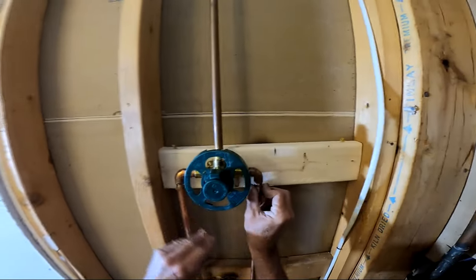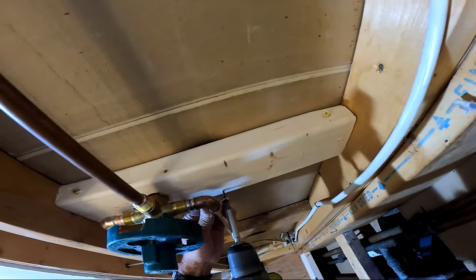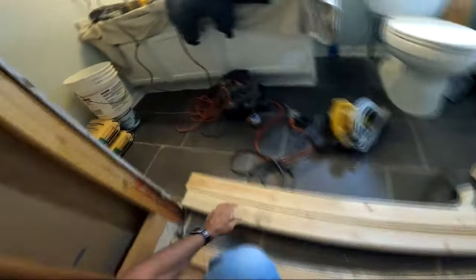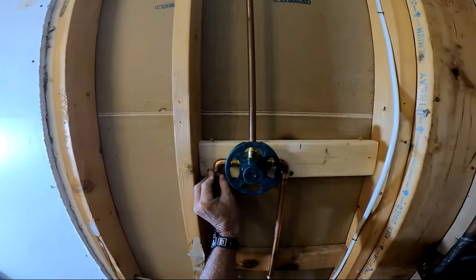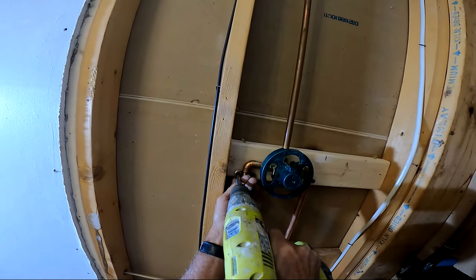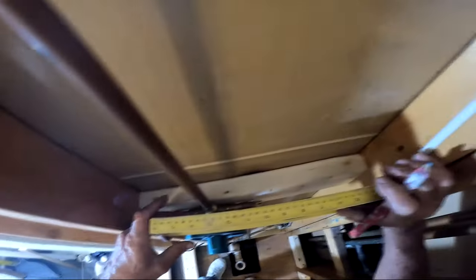For the anchoring I use copper straps, screwing into that piece of two-by-four I stuck in there. When doing your anchoring, you've also measured the distance sideways — I put a scrap piece of sheetrock up to that mud cap and know I've got half an inch of sheetrock, then another three-eighths for tile and a bit of thin set. I'm marking and making sure my mud cap is sticking out far enough to accommodate the backer board and tile.